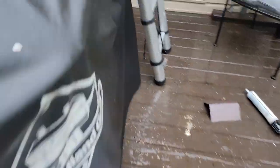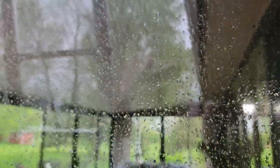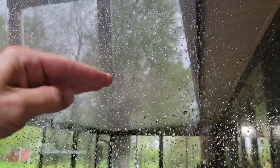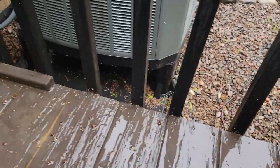Right down here on the bottom there's a little pan and you can see the carpet's a little wet. Up top you can see it right where the soffit and fascia board is. Typically when these porches are built on, it's like a foam core with thin steel on top. They don't go under the roof far enough, or they're not flashed far enough.